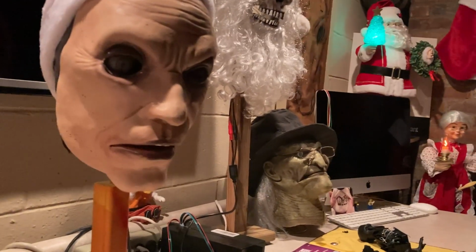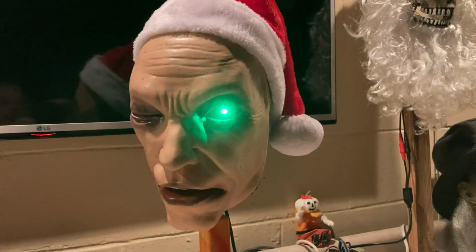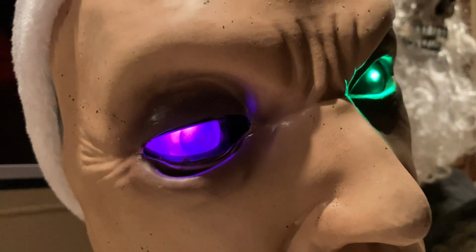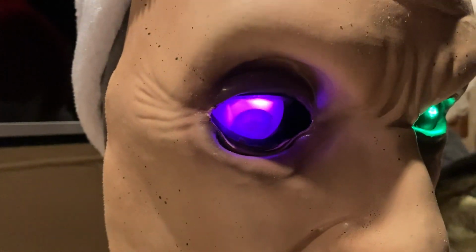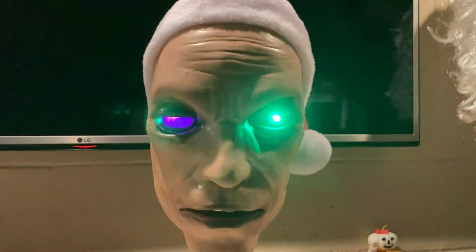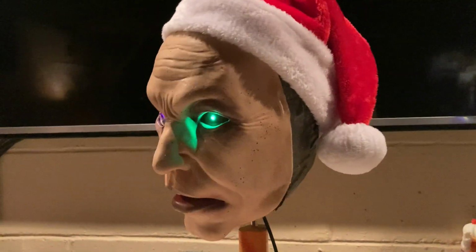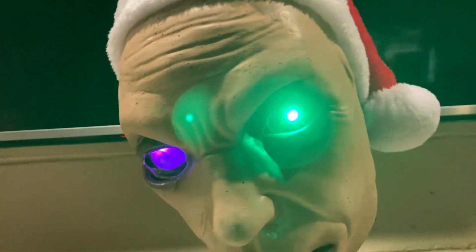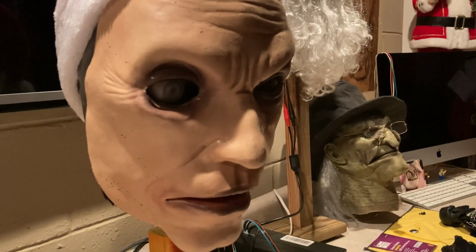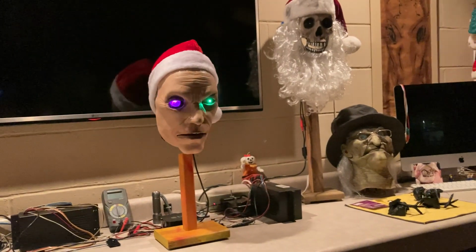And then kicking back up here, all the servo movements on the eye are perfectly fine. Close up going here, because the pupil is darker, the camera picks it up better if I get a little closer. And then the green laser LED, it definitely beams like I wanted it to. What it had before was the red laser, and now instead of the red LED I put a green high brightness clear one. And I showed you what the brand was and what kind I used. So, yeah, it worked out good. I'll back up here a little.